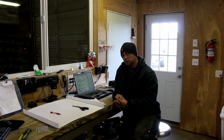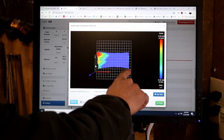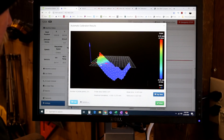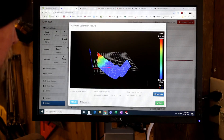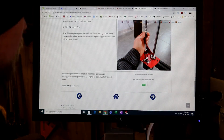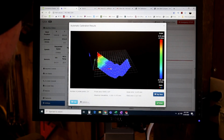That thing is done with two of its passes. You can see the distance map — this is the result of all the probe points it takes. Here's the top view — I think this is the back far right corner, front left — this is where we had the issue on that print. It looks like it still has quite a bit of issue on that side compared to this side. These distances are extremely exaggerated — they're about a quarter of a millimeter roughly. It looks like one of them is negative 1.03 at the very bottom, and the bed wants the difference between the lowest and highest point to be no more than one millimeter. We're about 1.4 millimeters off.